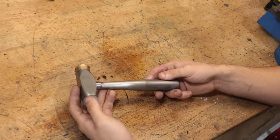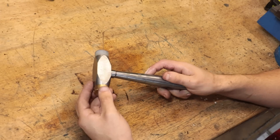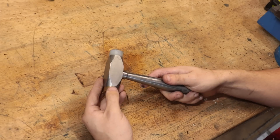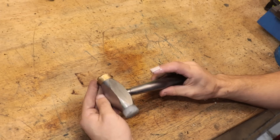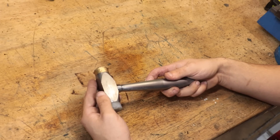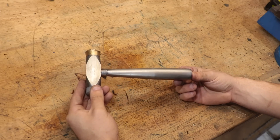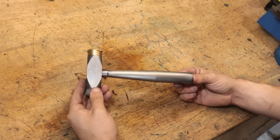Plus I'd like a second shot at making a handle. A steel one was a nice idea at the time because it adds a good amount of weight to the hammer, and that was really good when I was hammering in small confined spaces. But it really does seem to throw off the overall weight balance. What I will be keeping though is the removable ends — I think the combination of acetal and brass work really well together. The brass doesn't mar steel, and nylon goes really well for hammering plastic and aluminium. And to my surprise the brass has held up really well.